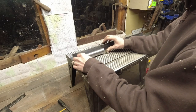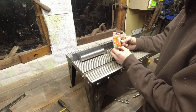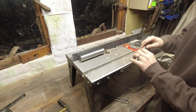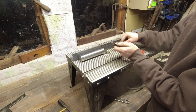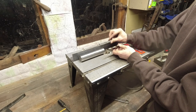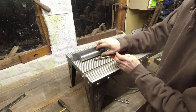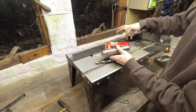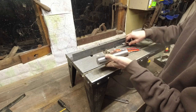Now I've got this somewhat trued up. The arrow shafts I'm going to make are eleven thirty-seconds, so I have an eleven thirty-seconds drill bit, which doesn't usually come in your standard kit. The square stock I'm starting with is three-eighths, and if you measure three-eighths square from corner to corner it's half inch. So a half-inch hole should accept a three-eighths square, and then we'll run it down to eleven thirty-seconds. I'm going to drill as much as I can, cut a couple chunks off to weld on here, then make the starting point half inch.